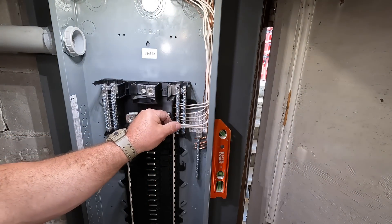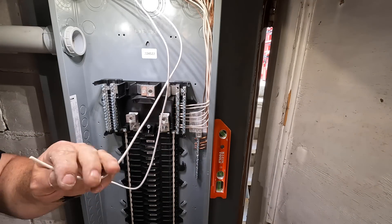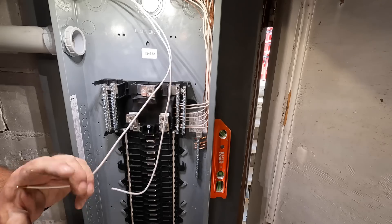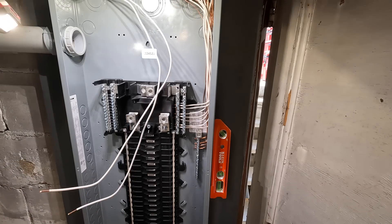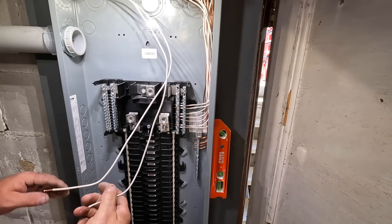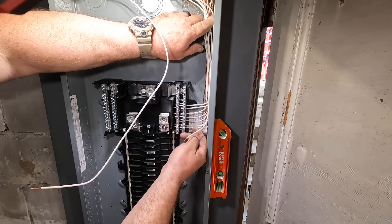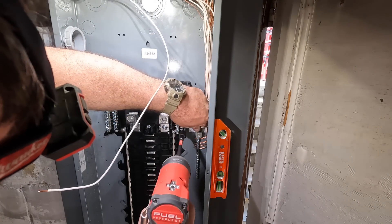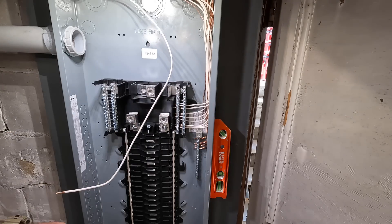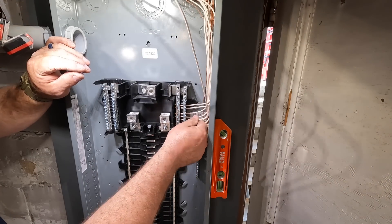You can see here why I wanted to get the male adapter and PVC coming into the upper left-hand corner where I wanted it. You can see the two main lugs that will supply the bus bar, the neutrals right up above, and then the four-wire connection — the equipment grounding conductor goes on the terminal bar I installed on the right-hand side. That's why we lowered the panel and positioned that PVC male adapter entrance to make it easy, without too many bends or a sharp bend into those lugs.